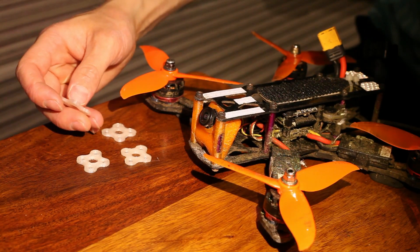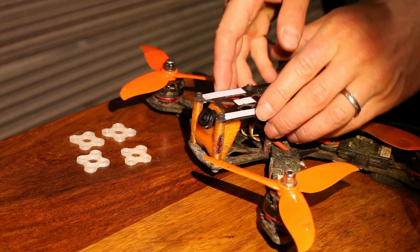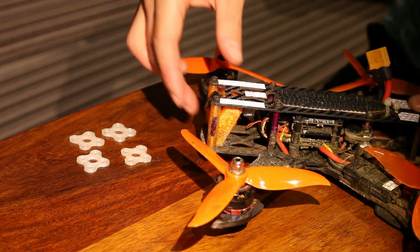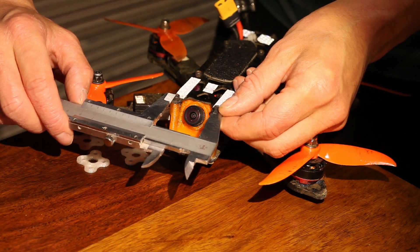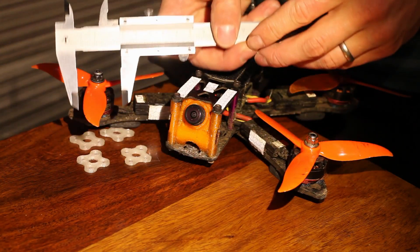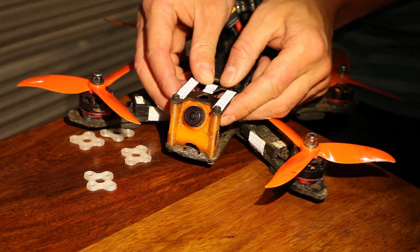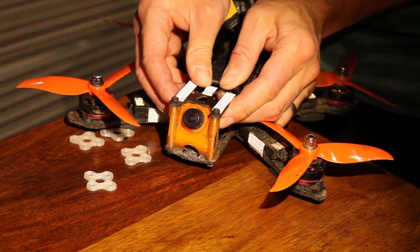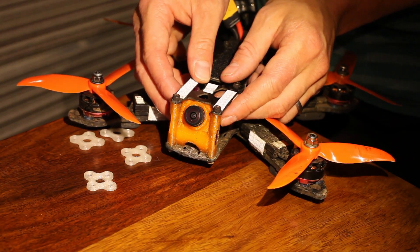But some jello still remained, so I spoke to Shane at PCRJ, and he suggested coming up with a custom mount for the Split, which is what's actually holding the Split in this quadcopter now. The distance between the posts on the Martian II frame is 32mm, and so long as your frame has a similar distance between the posts it'll fit. There is some flexibility in it, and that's enough to take out the final vibrations from the frame and produce smooth camera footage.